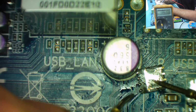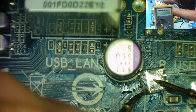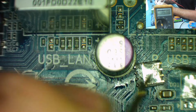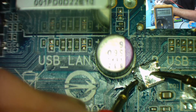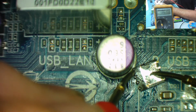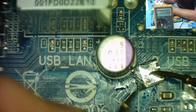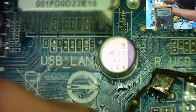Okay. So this is now turned on. Let me turn it off, and you'll see how I'm doing it. That's the gate. So see that bleep? Diode junction. That's the gate and source. If we put the positive on the gate, it's now switched on. Whichever one the gate is, it'll act like a short.